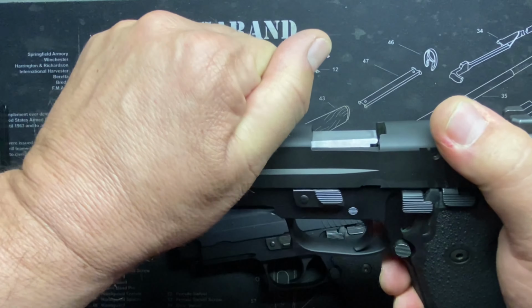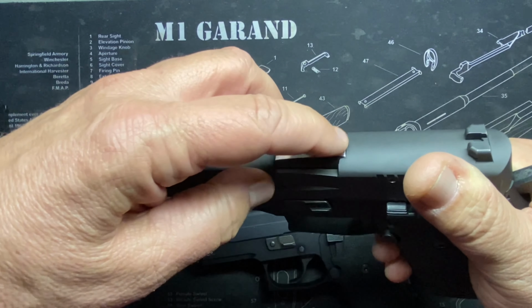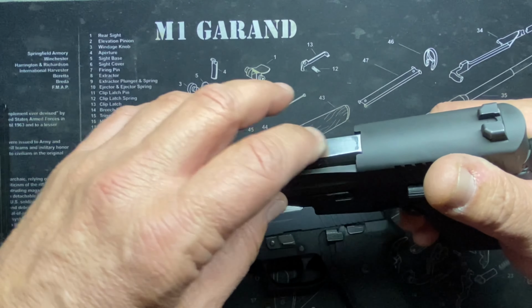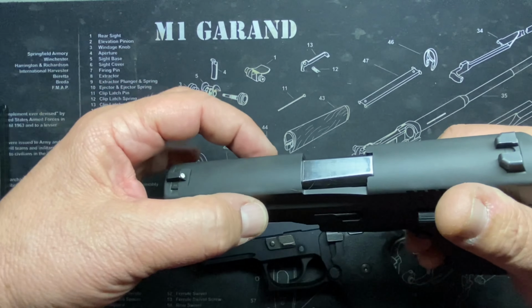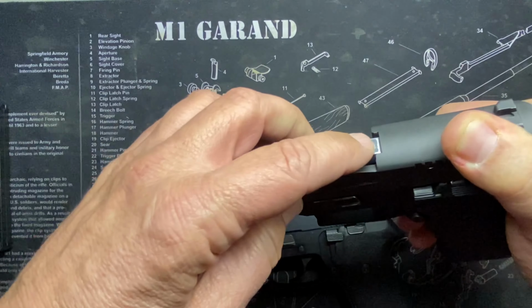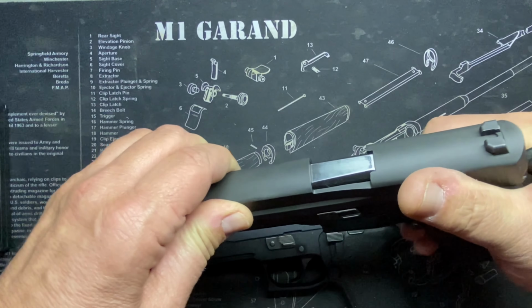battery. And this right here, the locking, the top of the barrel actually locks into the receiver. It's not like the 1911 or the Browning High Power, which has those locking lugs in the barrel. This is the locking lug right here, like into the rear of the receiver. It locks into that mortise in the rear of the receiver there.